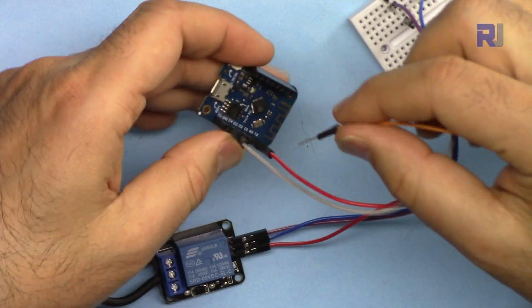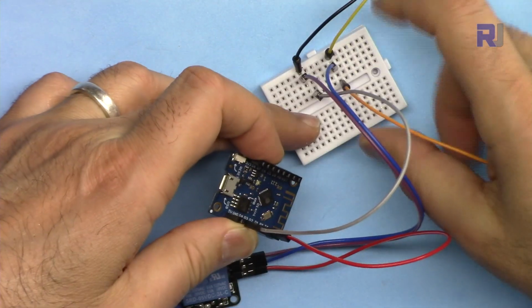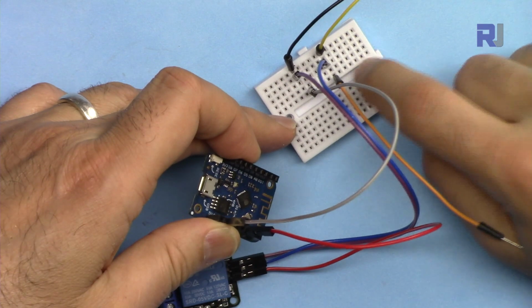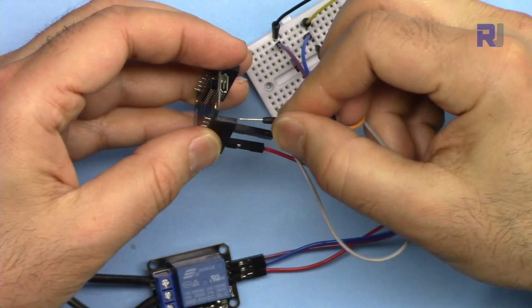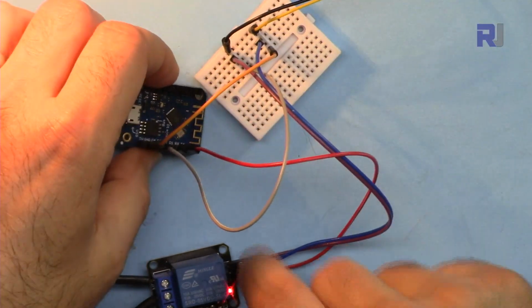And this one also can be powered up from external power. I'm connecting this wire to 5 volts on this line. These are all 5 volts. If you want to learn about the breadboard, I have a separate video. The link for the breadboard is in the description. So I'm connecting it to the last pin here, which is 5 volts. As you can see, it already turned on.